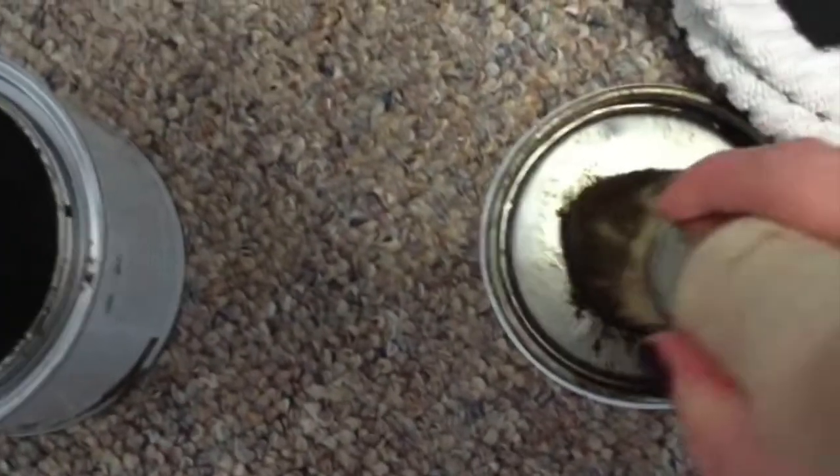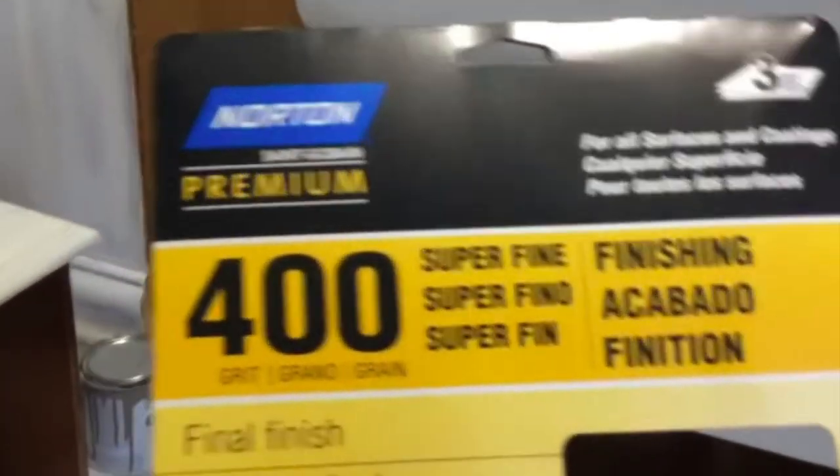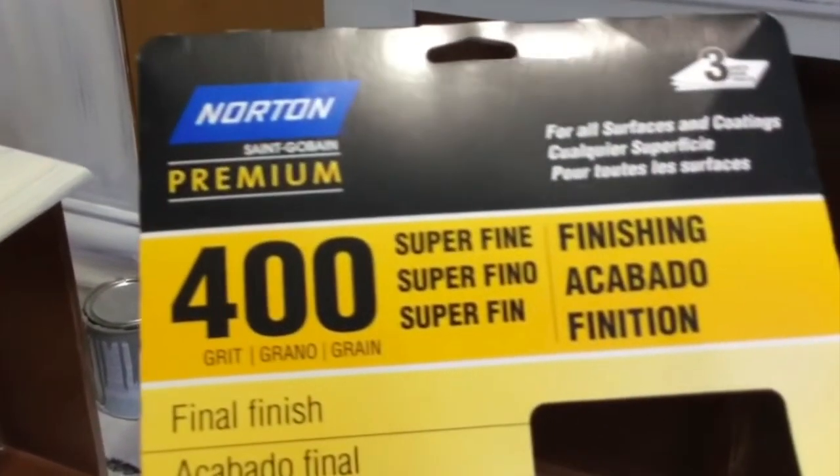The bottom I painted with old white completely. Here you can see the antiquing wax — it just made it a little bit darker, which is the look I was going for. If you don't want clumps of the wax, dip the brush and then take some off before you apply it. Then you still need to finish it off with clear wax — you brush it on, take a little bit off, come back a couple days later and buff it out until it doesn't feel tacky anymore. I also used fine sandpaper to distress certain areas to make it look a little antique.